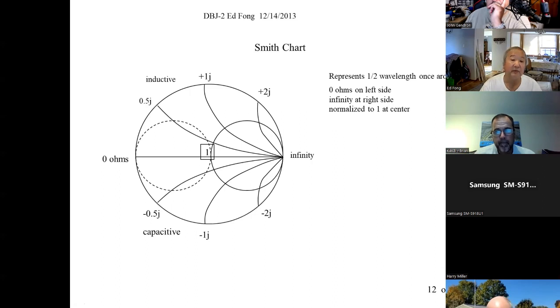Now, some people find that hard to believe if you think in terms of DC. This is not DC, it's AC. And the way I break this lock you have on DC is I show people this. Well, let me show you a quarter wave stub. Got one. Here, it's about a 5-inch piece of coax, 4.5 or so. That's a quarter wave stub at UHF. It's just RG58, nothing fancy.